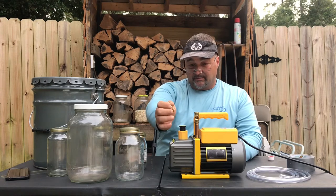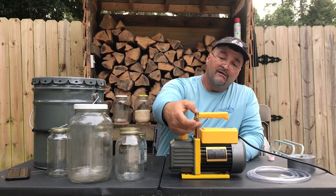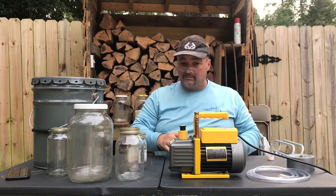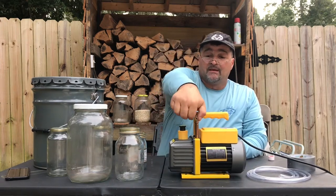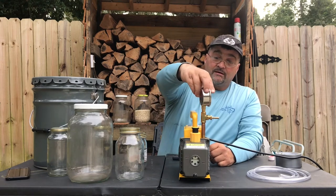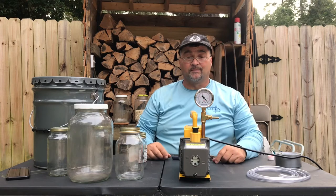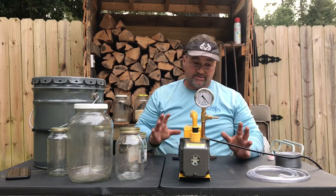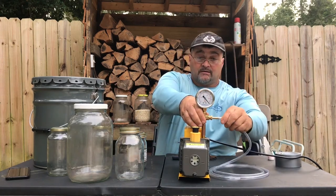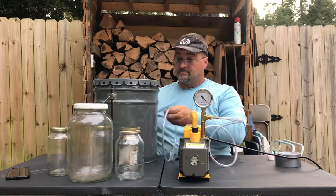You can do it this way, or just put the hose barb straight into where the threaded nipple is. In this case I'm going to put the hose barb on here — it goes right into this side. I'm doing everything finger tight for now; I'd normally take my crescent wrench and just apply a little bit of pressure to tighten things up. So now that sticks out sideways, and then I'm going to take my vacuum gauge and screw it right on top — just get it snug.